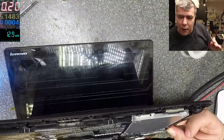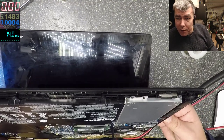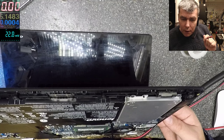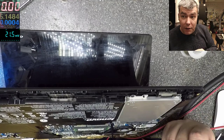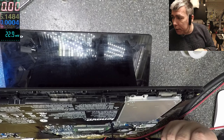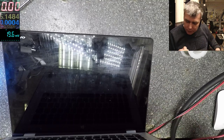What's that thing? I think I moved my 1.3 from the power supply. So obviously, if now RAM doesn't have any voltage, I'm supplying the RAM voltage with this, and I fool the Super I/O chip, the power supply is outputting power good. It's reporting everything is fine here. The power supply is up and running, but it's not. So I fool the Super I/O, and I'm supplying with the power supply 1.3. I have no idea if it's 1.35, how much it must be. But anyway.